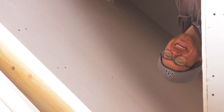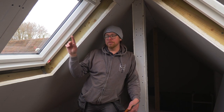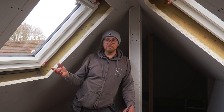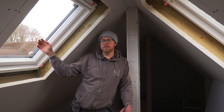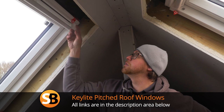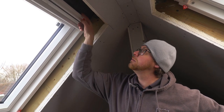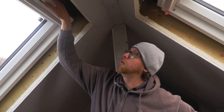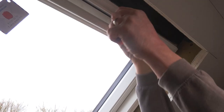We've had a few people asking since we installed these roof windows how we're going to finish it off with plasterboard — the preferred way that allows for proper heat circulation around the room so we're not causing condensation on the windows or heat build-up. This is a unique feature of Keylite windows: there's a pull tab on each side, and once pulled, a thermal collar fills out and completely seals all the way around the window to ensure there are no drafts. As soon as we pulled it, it started to expand already.